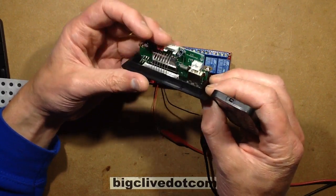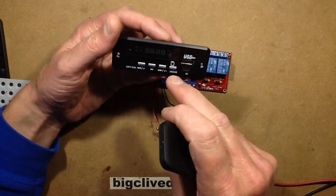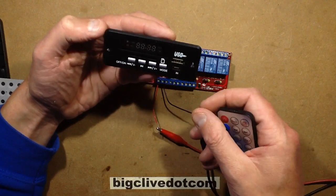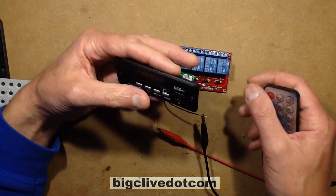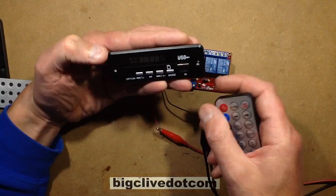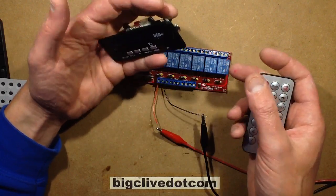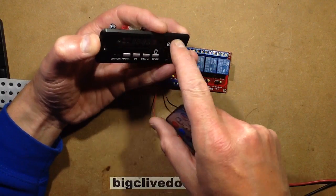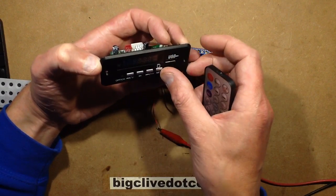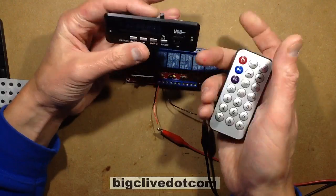And if you want it as a sort of background effect on, say, an arcade game, then you can create a string of files and tell it to repeat play this string of files, and make a big pause of silence between, say, audio samples, like the sort of things that would encourage people, like the arcade games you'd get. "Hey folks, it's the number one game sensation," or "It's an easy game, anyone can play, and anyone can win," you know, the sort of jingles. You can get silent MP3s, basically an MP3 that lasts for a minute and it's just silence. If you find the numeric sequence that this thing munches through the files in, you can intersperse. You can have an audio jingle, then a 30-second silence, then a musical burst, and then a 30-second silence. You can basically create a USB memory stick with all these samples in it, and this thing will just munch through it.